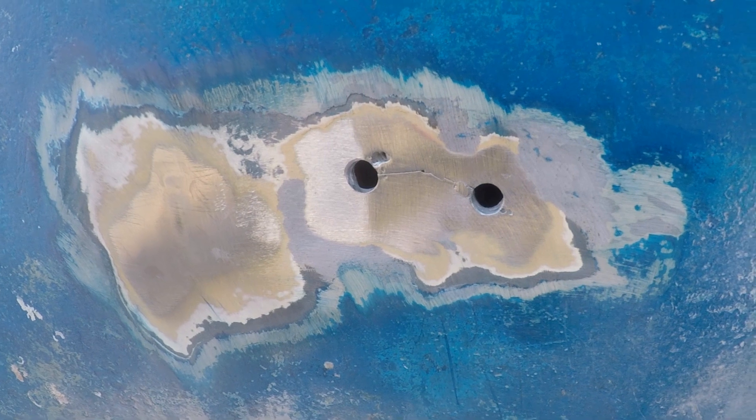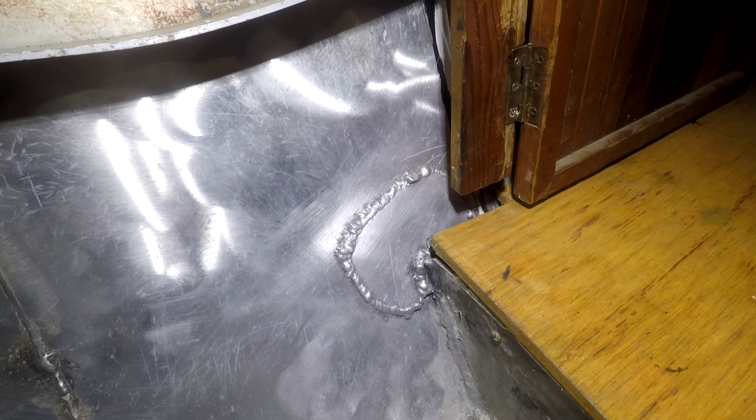If we go over here, this is the corner of the integrated fuel tank in the boat, and you can really see the cracks radiating from there. So what I'm going to try and accomplish on this go around is: grind that out, cut out the crack, put a little hole in the end so they don't keep going, cut them out in a V to make a place for the weld, weld them up, and put a doubler plate over top. And it should be strong enough.